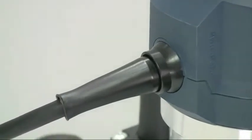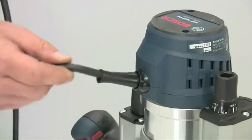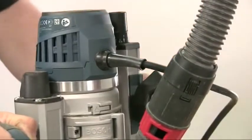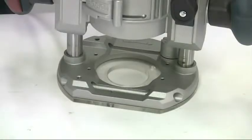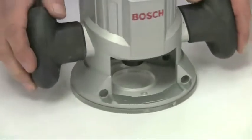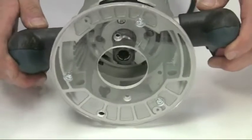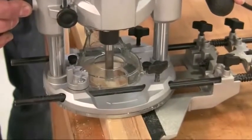Another very neat feature is a ball and socket attachment of the cable into the motor housing, which allows you to adjust it to the most convenient angle for where you're working — very simple but so useful. The most noticeable feature of this router is the large base opening, particularly on the fixed base, which gives much better vision of the cutter. This is further enhanced by the plastic sub base that maximizes support without obscuring your view.